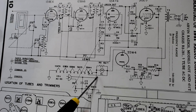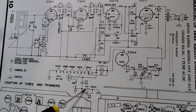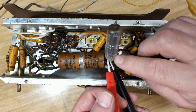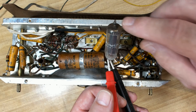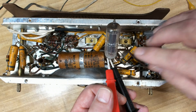Just looking at the schematic - it runs through the filaments here and goes straight to the B minus. So there's nothing there if there was something wrong with capacitors shorting or something - it's not going to affect that. The only thing I can think of that explains that dim bulb operation was that the filament in here shorted to one of the other elements, cleared itself and started working, but next time I turned it on it didn't clear itself, so I just burnt the filament out.